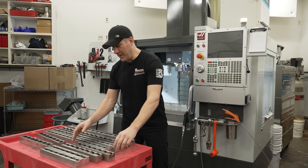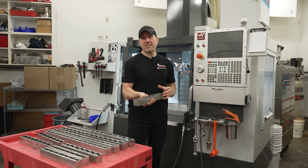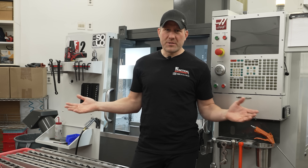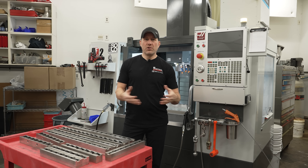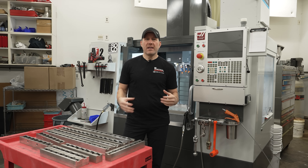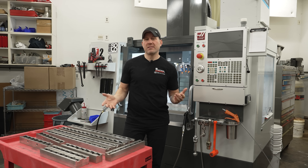The clamp rails, the way they mount - obviously you have to put pins and bolts in them and this takes quite a bit of time. The advantage is obviously you get the whole table and maximum runtime. If I was to do this again, I would probably have a ball lock or a uniblock or uniball system where I can lock these in and put them in really fast and not have to deal with putting the bolt holes in them, the pins and stuff like that. But if I was going to go that route, I might as well make pallets.